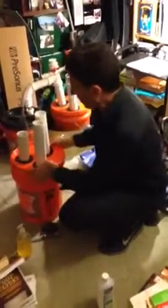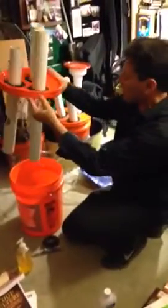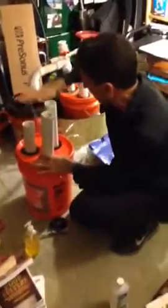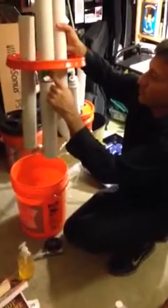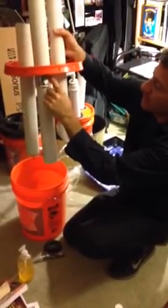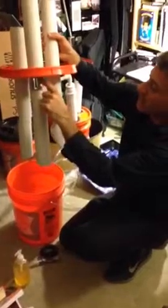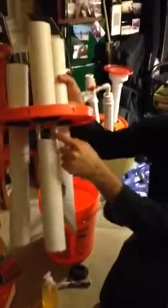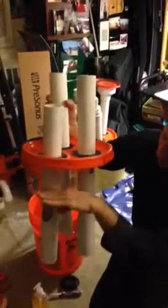And the way we've designed ours is that when you do push the pipes through, all 3 of them go all the way to the bottom, so you don't have to worry about how far to push. You just push them until they touch the bottom. The only critical thing is that for the gas out, make sure that the outlet is not up in the uniseal where it could possibly leak, but it's not too low. So you really want that gas out to be right up, almost flush with the uniseal. The placement of this fertilizer outlet hole doesn't really matter as long as it's below about half the tank so that the gas can build up here and not escape up there. This is supposed to be submerged in liquid.